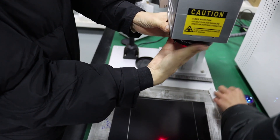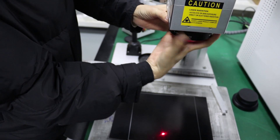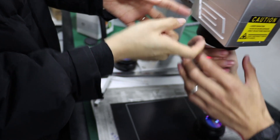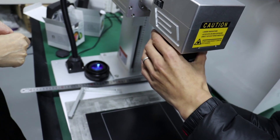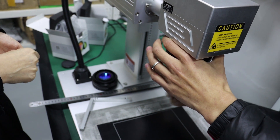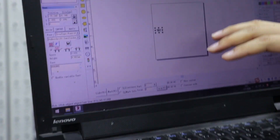Now we remove the 200mm lens. If you use the OPEX F-theta lens, you need to remove the lens and use this one — this is the lens which connects the laser head and the F-theta lens. Now put on the 300mm lens. We need to tighten the focus. After changing the 300mm lens, first we need to find the focus using the same method. We need to import the logo, head attach and find the focus. Click that button and rotate the hand wheel.